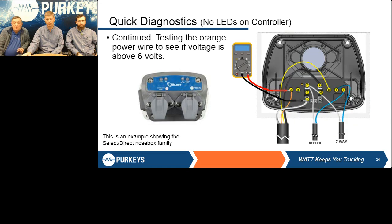We'll show where the leads need to be on each controller style. On our newer Select/Direct system, positive goes to the orange wire and negative to the negative wire. On our Direct Flex Plus system, the positive is on the orange wire, but the negative ground lead goes on the opposite side of the fuse on the white wire going into the four-conductor. That fuse could be blown, so you need proper lead placement. We have a fuse on the ground side to protect the four-conductor — there was a past instance where a bad ground in the pump box melted and burned the four-conductor. Always make sure leads are in proper positions and that you have more than 6 volts.